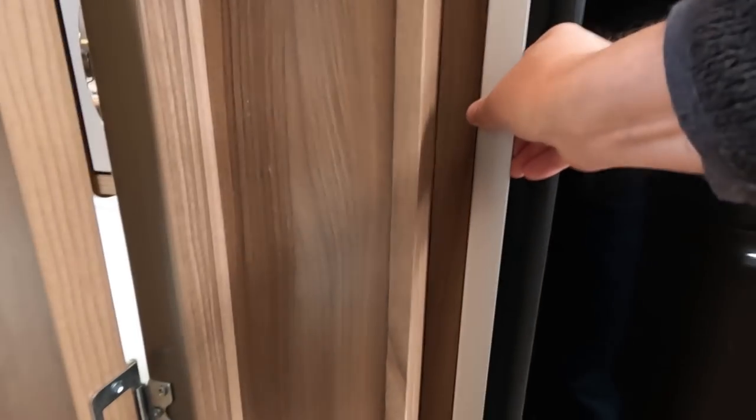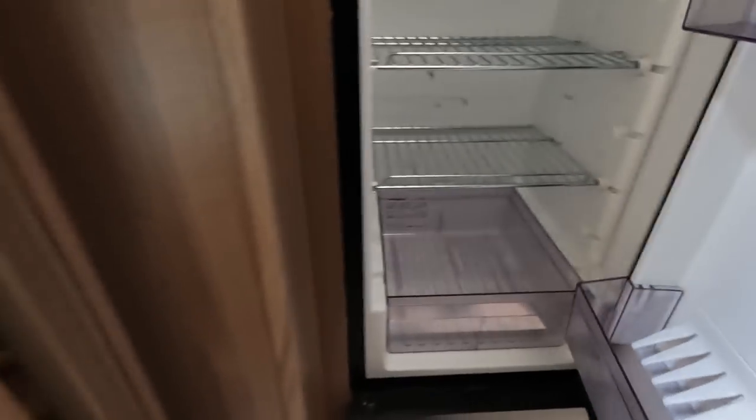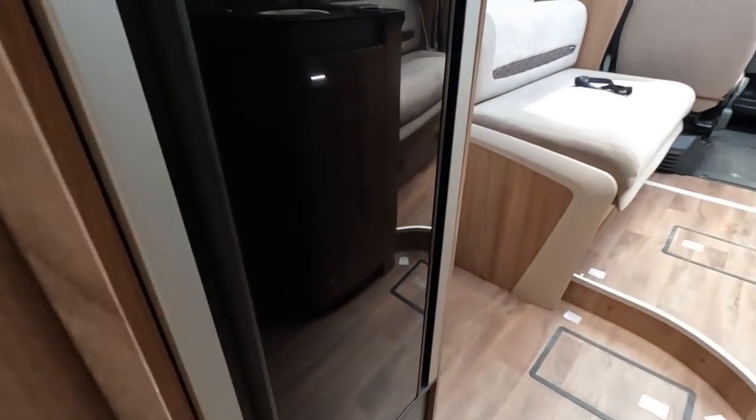Can you see the gap just there? If you look down at the bottom, there's hardly any gap at all, so whether they need to put some shims in at the bottom to lift the door up. But if this door doesn't properly latch, you've pushed it here to shut it - you're meant to be able to open it the other side, but now it won't open the other side. So you have to push that in and then you can open it that way. I'm not a great fan of this double door idea.